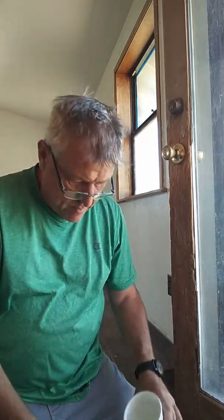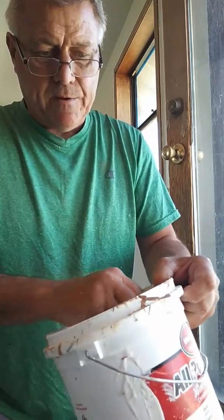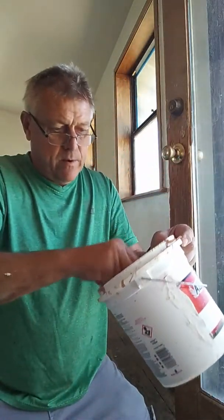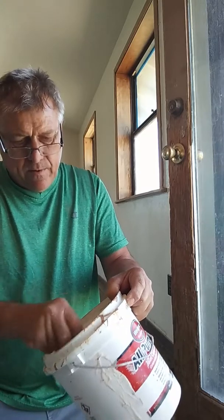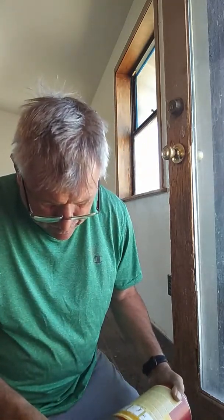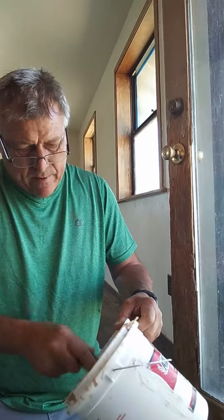The smart thing is to get water in a little container and just dump in a little bit at a time, then mix your water putty up. It takes a while to get used to how much water to putty you need. I usually just mix a little bit. You want to make sure all your clumps are out of it. That was a little bit too much water, but I've got a pretty big area, so I'll put more powder in. I usually describe it as the consistency of oatmeal — you want this to be the same consistency.